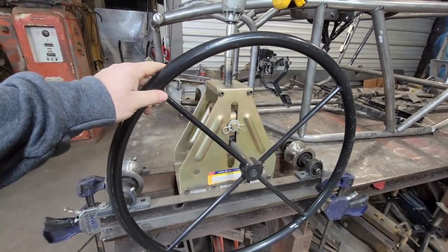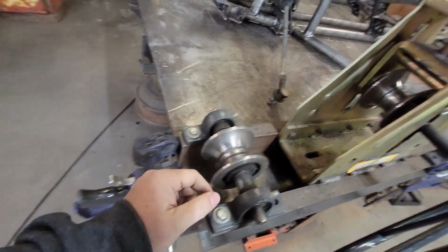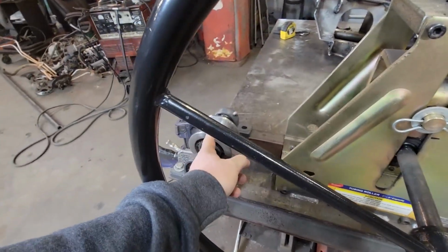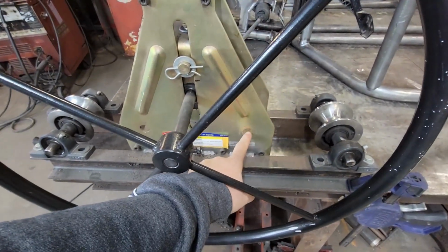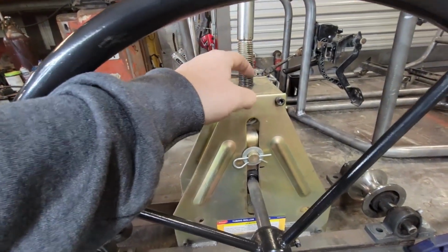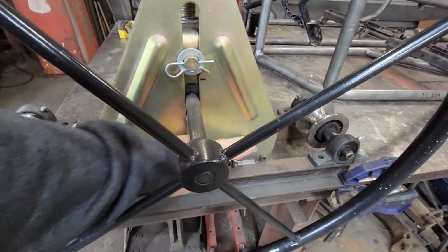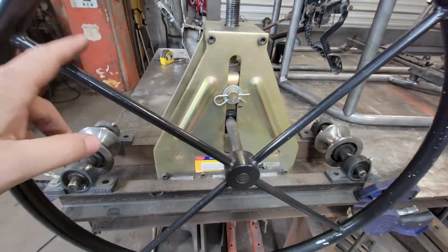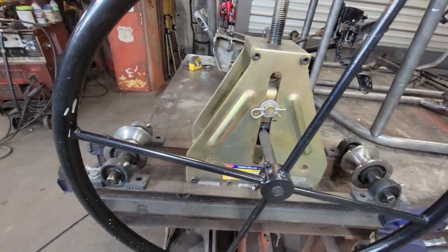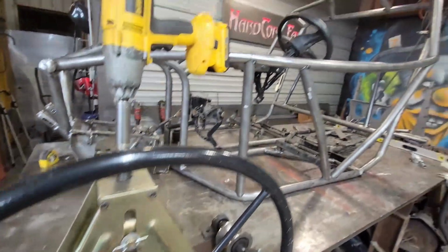The parts that came with this thing from Harbor Freight are this wheel here and this main body, of course, and also the rollers that are inside the main body and out here on the edges. Those all came with it, and the way it worked originally is these rollers were pinned through that hole and through this hole over here. It's a pretty simple deal because all you've got on top is a screw that threads in, and as it threads in, it pushes down this top wheel. The top wheel then pushes and gives a little bit of a bow into the metal between these two rollers. Then as you feed it in and push it right on through, it's going to give that bow to the metal. The theory is pretty simple and basic, but it just doesn't work, especially when you're talking about big heavy tubing like all this DOM.